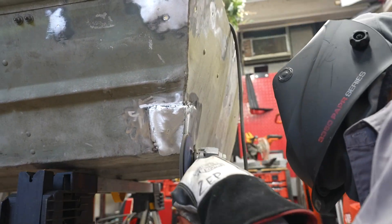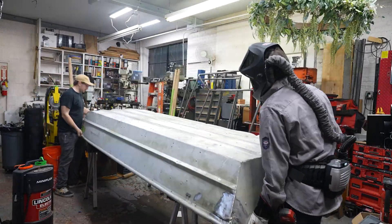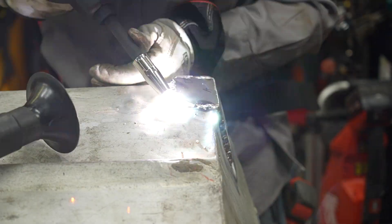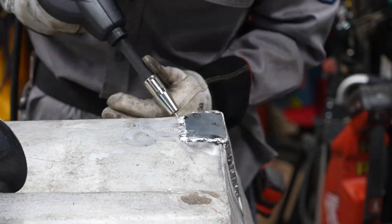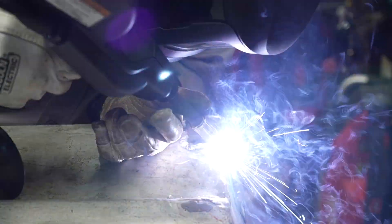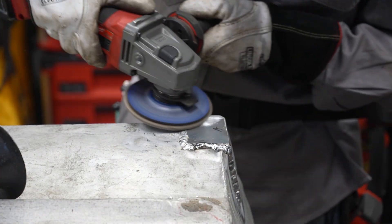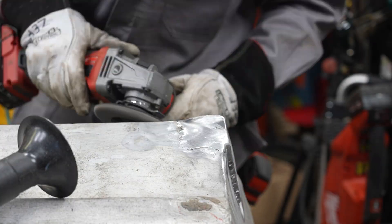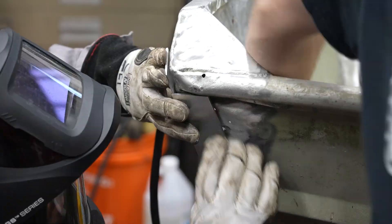Welding around the outsides of this to the boat hull is going to be tricky because that material is still very thin, but I kind of bounce around with my heat and try my best not to burn through. What was really good about this was once I was done, I noticed that I did penetrate through the base metal and I could see some of my weld on the inside, which made me know that this really stuck. I could also go inside the boat and weld from the inside out because I had that nice eighth-inch backing behind it that I could make really, really strong. After welding, I ground everything to smooth things out, make it a little more hydrodynamic, then flipped the boat over and welded the bottom section. There was about a three-quarter inch hole in the back corner of that boat and we definitely wanted to make sure it didn't leak there. After welding that base material to the hull, I got a pretty good bead — it didn't really burn through — and while it was still warm I could hammer it into place and try to retake some of the shape of the boat. Nothing a grinder can't fix. This thing's not winning any beauty contest, but it's definitely going to keep the water out.